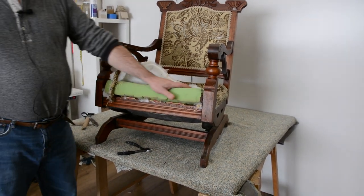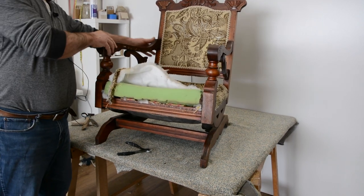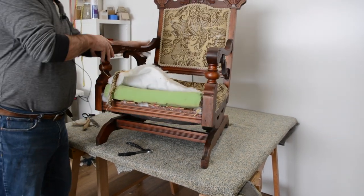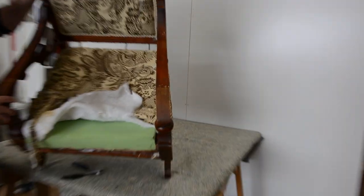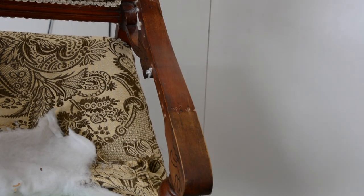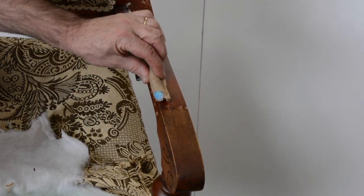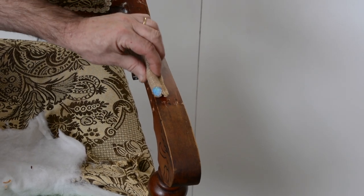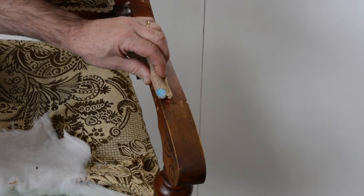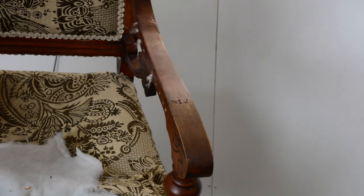We're going to be doing this at the shop. Hopefully we can post a picture of this when it's done, just to show you the difference. I also wanted to point something out on the arms — I took the fabric off the arms and they had absolutely no padding on the arms at all. You can see where there was a heavier padding at one time. On the arm, you'd go to a smaller edge roll and profile it up, then fill in between with perhaps horsehair, hay, or coconut fiber, then cotton and muslin just to give it more oomph for your elbows.